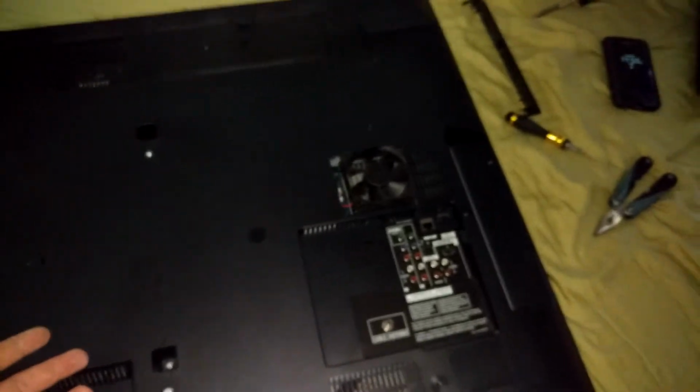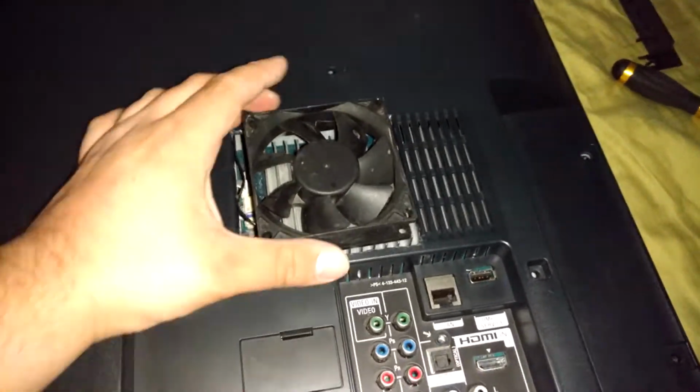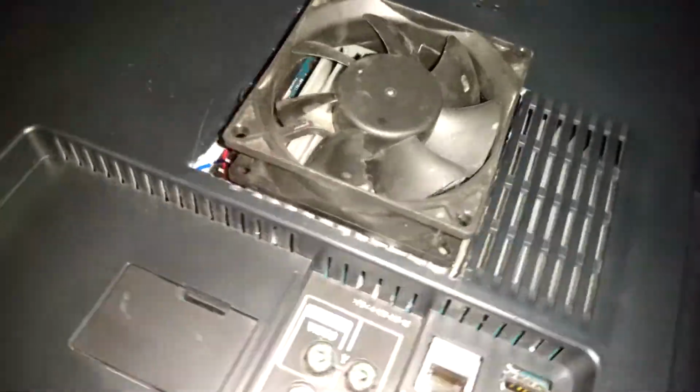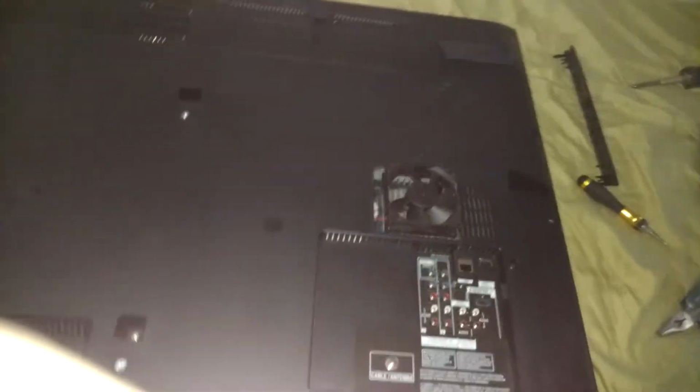you're doing that and heating it up, which is actually the heating up which fixes it, a lot of the time it'll be good until it's under heavy load and it heats up again, and then everything sort of shifts out of place. So I'm hoping I can keep it basically as cool as possible and preserve it in a working state. But yeah, so now all that's left is to basically hot glue that fan onto the heatsink, and should be good. But let's go ahead and just give her a test to make sure that thing's still working after sitting for half an hour plus.